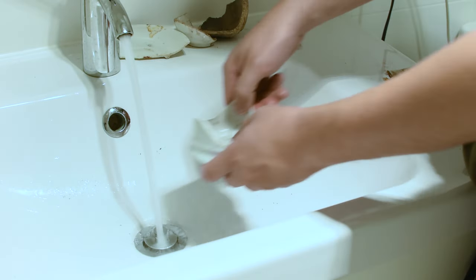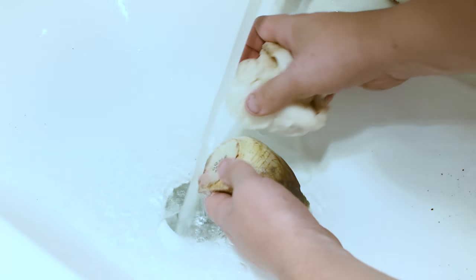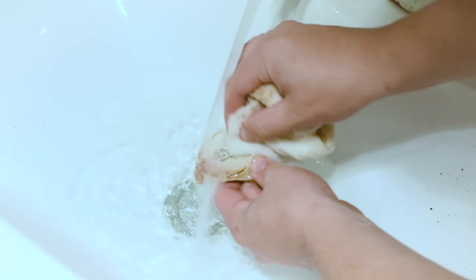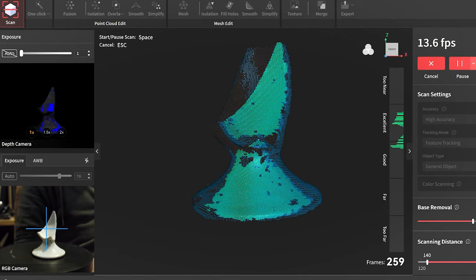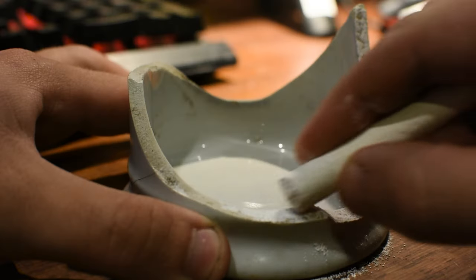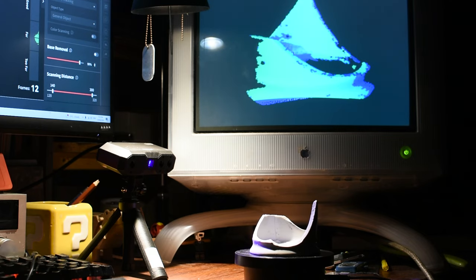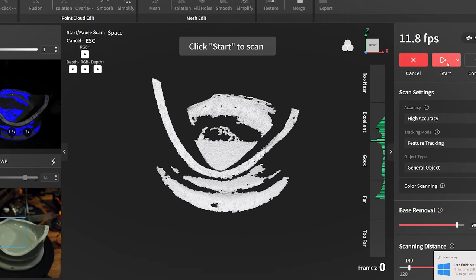It begins with thoroughly cleaning the pieces to remove any dark spots. The Revopoint Mini 2 scanner they provided me gets better detail from clean, white surfaces. I initially tried scanning these straight after washing them, but the small dark spots were giving me less accurate scan data — close, but you can see there are pretty clear pieces missing. To remedy this, I took chalk and rubbed it along the edge of the piece, and this resulted in much cleaner scanning data. You can see just how much crisper the edge is appearing.